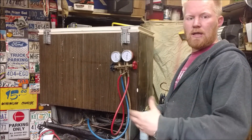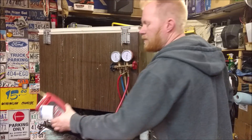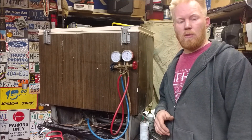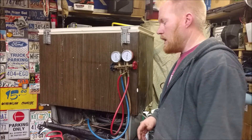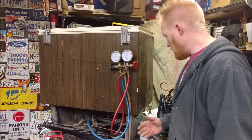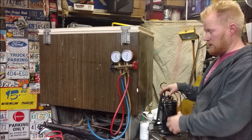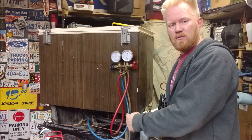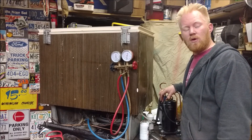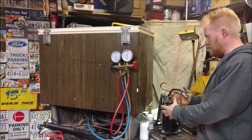Better than that are electric pumps — that's what HVAC guys use because you don't want to carry an air compressor out to a job site along with the venturi pump. Electric units are very efficient but they're in the hundreds of dollar range, some up to a thousand dollars for the best ones, rated by how many microns they can pull. Even cheaper, if you're doing this on a budget, is an AC compressor — the same thing that's right in there. If a system isn't salvageable, you just take out the old compressor and use it as your vacuum pump, or find one on Craigslist.